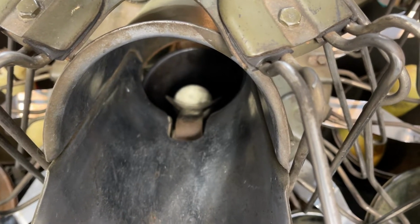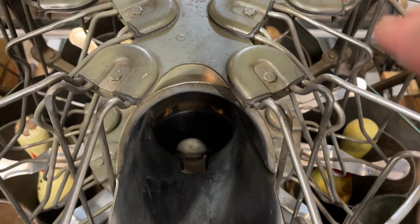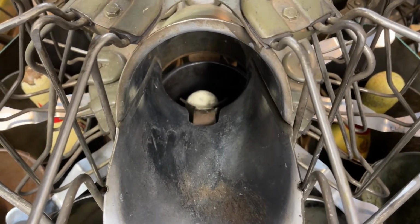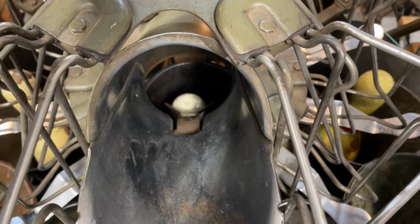hold that pin release lever open. See right now where it's kind of holding it down, it's almost touching the 5 pin right there, but you might check to make sure your turret's level. If your turret's low in the front, it's going to make that tongue hang down lower, and that 5 pin, top of that pin can hold that tongue down.